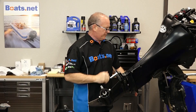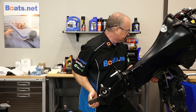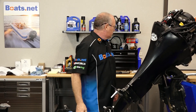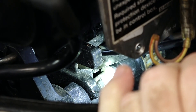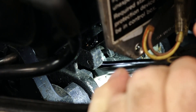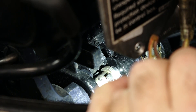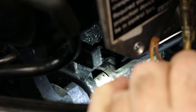Next, let's go ahead and lower it back down. We'll get the shift shaft reconnected and then we'll pretty much be done with this one. What we're doing is we're going to take that pin right here and put it into the top of the shift shaft. It looks like it's fairly close but not quite — there it goes. All we did was just slide the pin in, and now we just take it and rotate it down. And that locks it in position.